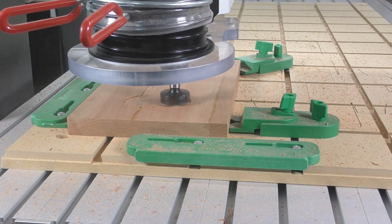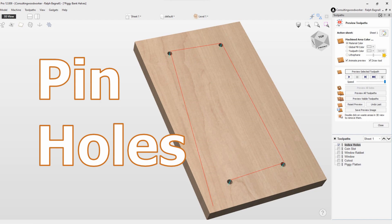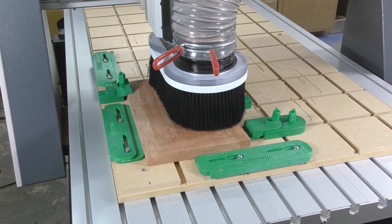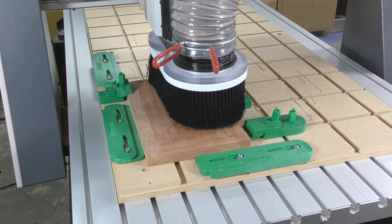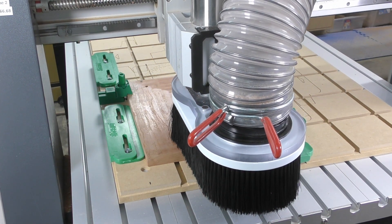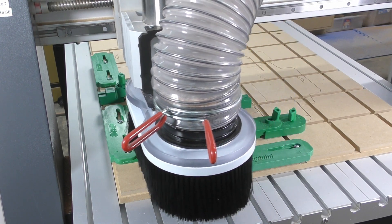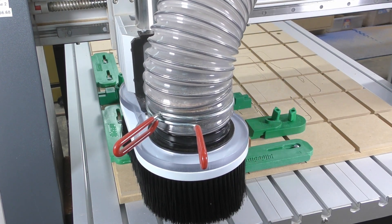The bank is made from two pieces that get pinned together, so we'll start by milling those holes first. The holes were drawn at 0.26 inches in diameter so a quarter inch bit can clean them out without drilling straight down, which just causes burning. Notice the bit twirling tightly as it cleans out those holes.